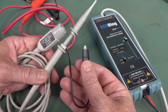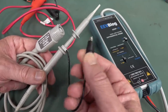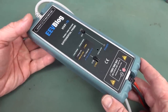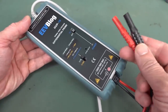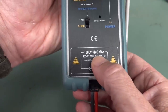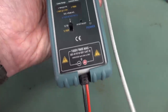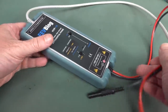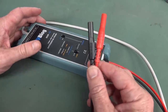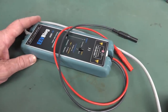Things like mains switching power supplies are mains earth referenced, so if you plug a regular probe on the wrong point, it's going to vaporize. The high-voltage differential probe lets you safely put either the ground or the positive lead anywhere in your circuit — up to 1000 volts RMS maximum between the two terminals, with a common mode of plus/minus 700 volts — good enough for any mains switch-mode power supply. You can connect your probes anywhere and be completely safe.